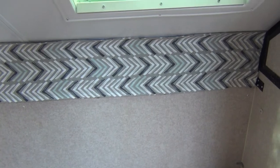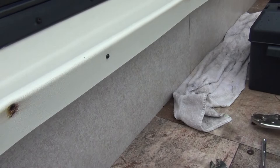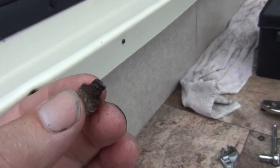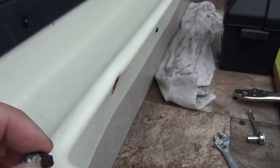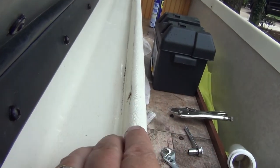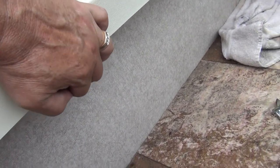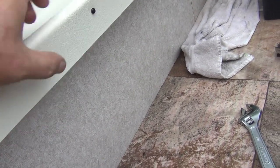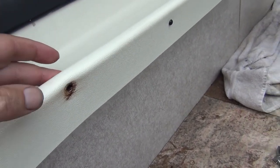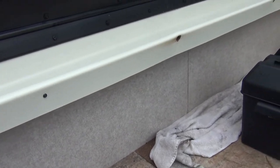I went over to the front compartment and tore down the lid. There are four bolt holes holding it on, and this is what they used — you can see they've rusted through because they're getting water. What happened is water hit the back side and worked its way through the hole. There's a strip of plywood underneath that's all rotted away. It's coming through these holes because they never installed any gaskets or put any sealant on it.